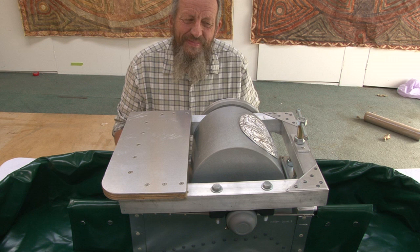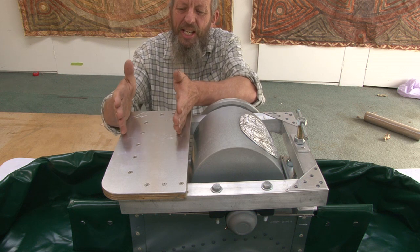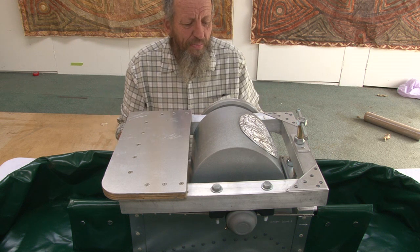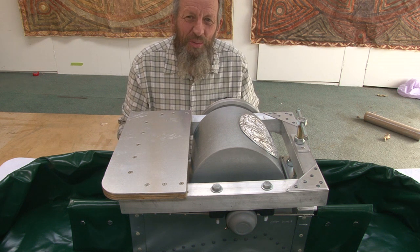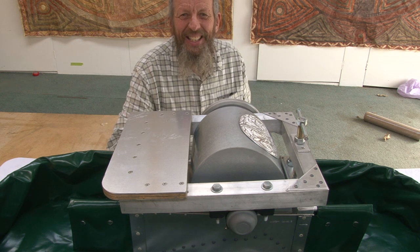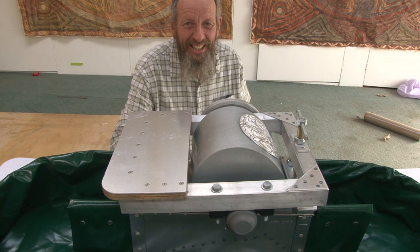And the other reason why I don't supply motors is that if you fit it yourself, you have some idea how it's done. It uses a fan belt. You may need to tighten that at some point in the future, and you'll know how to do it. Most people can do it themselves with a drill, a couple of spanners, and if you can't do that, you're bound to have a friend, or you can have a motor fitting party, and it all generally turns out okay.